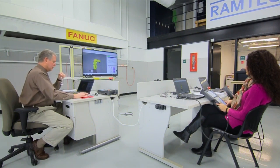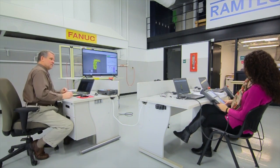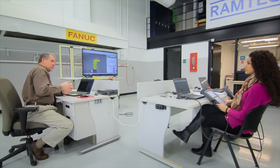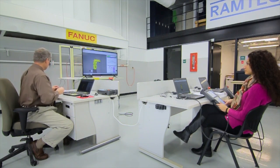Keep clicking down until you reach 5%. From 5%, if you keep clicking, it goes in increments of 1 down to 1%. Then keep clicking and you get Fine, then Very Fine. That is evidenced in table 6.2 in your book. It's important to know that when you get to Fine and Very Fine, those are pulsed speeds — you can't hold down the position key. You've got to tap it over and over again. In Very Fine, the movement is so small you can't even see it move, which is testimony to the precision of the equipment.